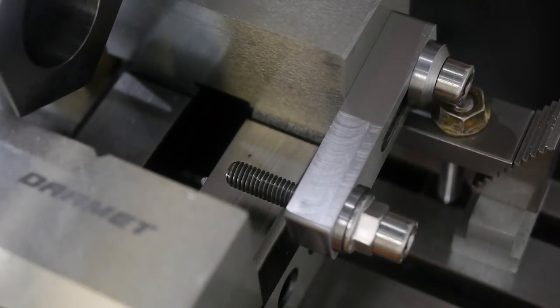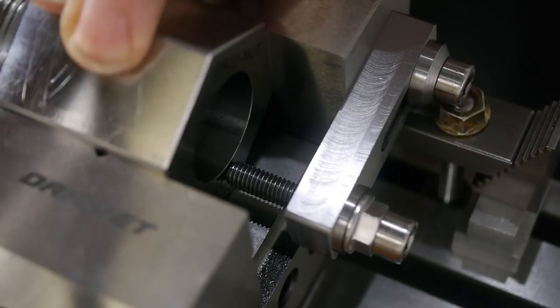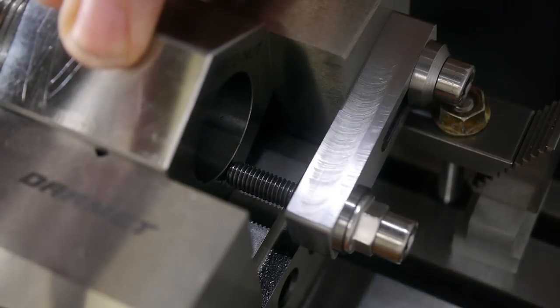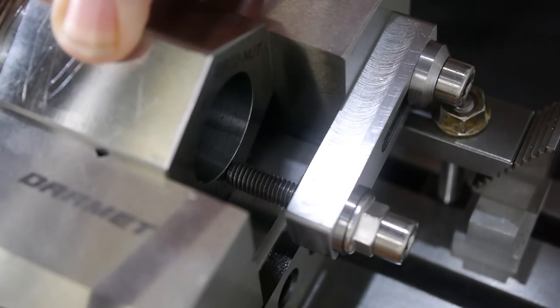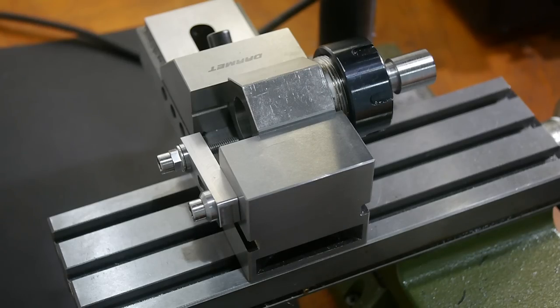While the nut is still attached to the rest of the shaft, it's much easier to hold in a chuck or collet due to the extra length. That's why the next operation I chose is milling the hex in the top part of the nut, as this requires the part to be held with plenty of clearance for the milling cutter. ER collets aren't as good at holding very short parts, as they are primarily designed as a spindle collet.